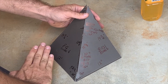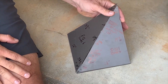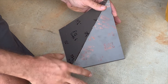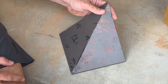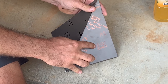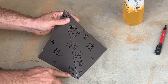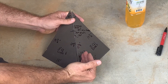This angle here from the ground up to the eave is the eight on 12, which is 35 degrees. Then we have a third angle — from here to there — which is what you need if you're going to cut off this metal hip at the bottom of the roof. For an eight on 12 slope, this hip is five and eleven sixteenths on 12, and this third angle here is 14 and seven sixteenths on 12, which is 50 degrees. You can use a construction calculator to translate between those.